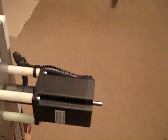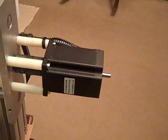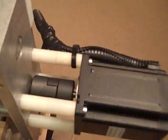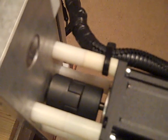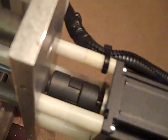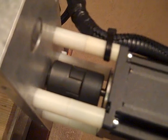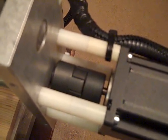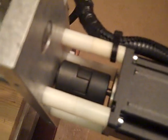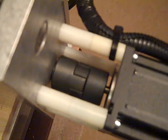Here we have these Keling CNC pulse stepper motors attached through a Lovejoy L050 series motor coupling. These are available in one-quarter, three-eighths, or one-half inch or maybe even larger bores. This particular setup is using a one-quarter to one-quarter bore coupling with a rubber spider between the jaws.